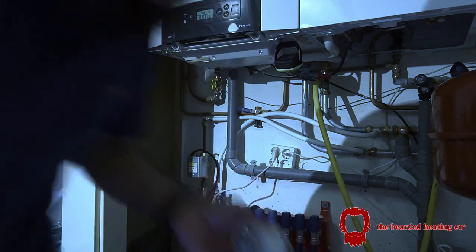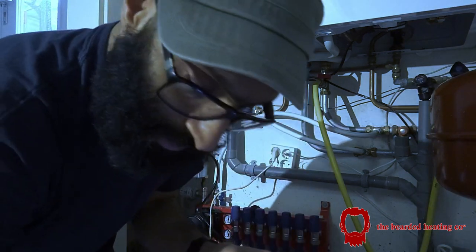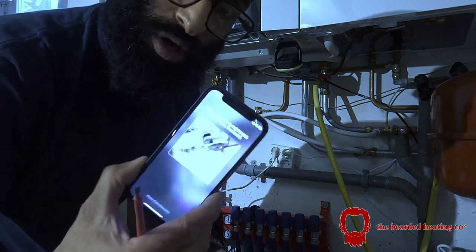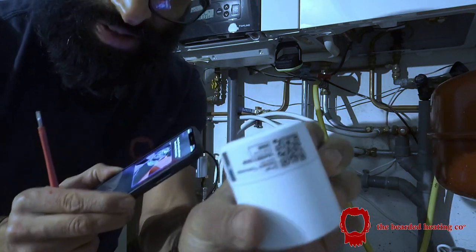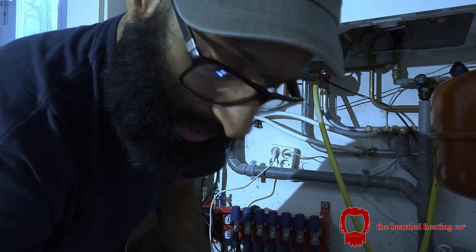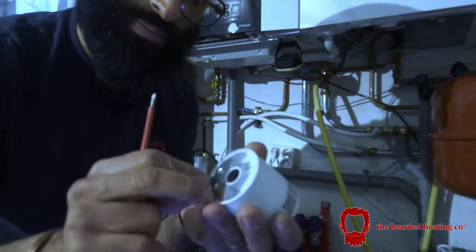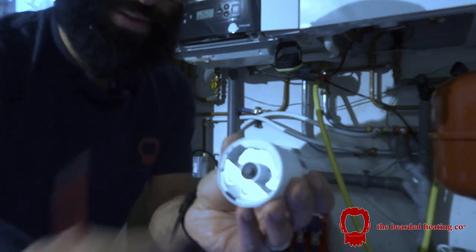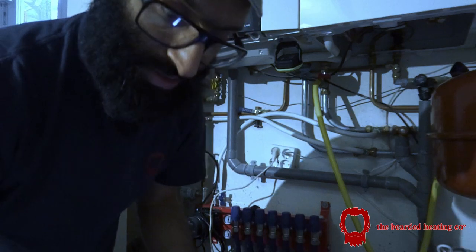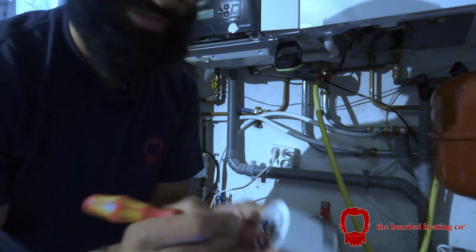So in the app, you basically have to choose what you're doing next. I want to install a head, so click on the thermostat head, and then it says start registering. It gives you a QR code reader. On the thermostat itself, it has a QR code. Basically, you scan it, and then it'll just say register. You register that, and then it tells you to remove the cover from the battery. Remove that. It will then say hi. Press next. Just follow the instructions on the phone.